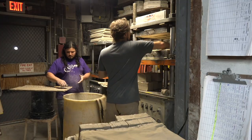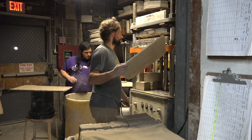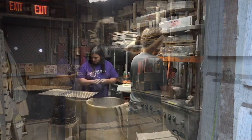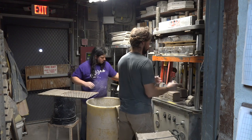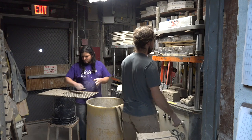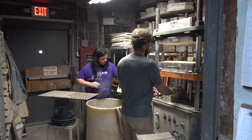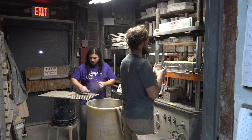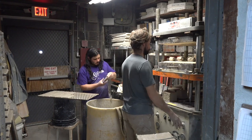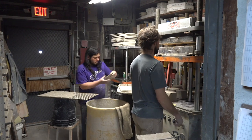Pressing clay using the ram press involves 2 workers. First, workers position the tray in the press. Next, workers will get a sliced loaf of clay. They then position the sliced loaf of clay on the ram press staging area. Workers then get the slice of clay and fold the clay piece. Workers break the slice of clay in half and position the clay piece in the press in groups of 9 pieces per tray. Workers then activate the press.